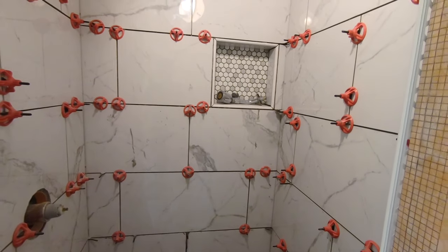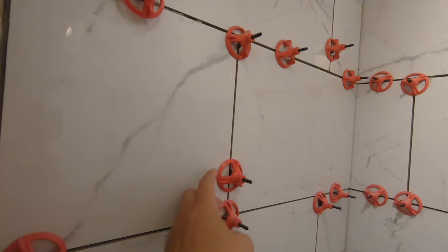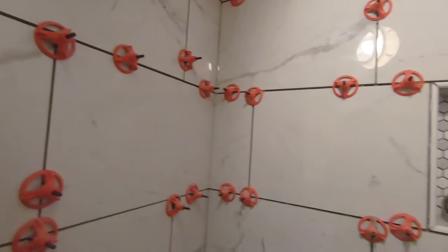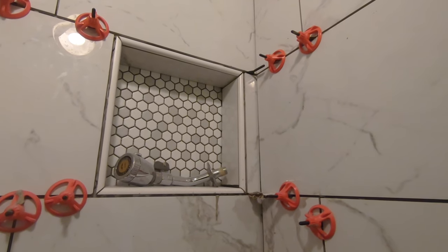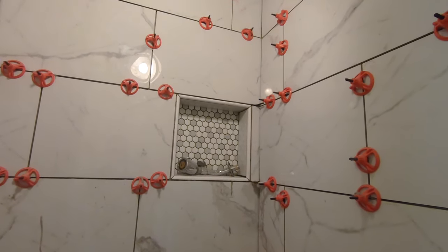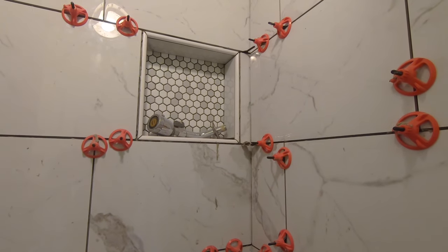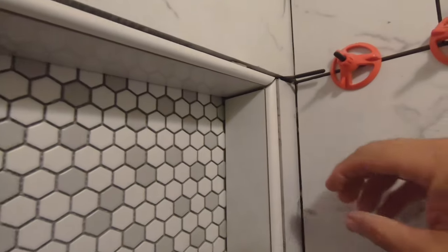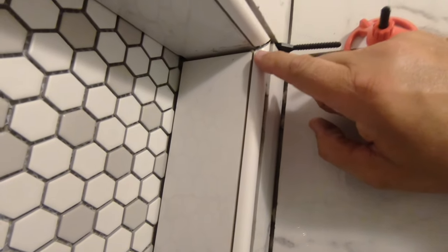Here's the shower that we're working on. As you can see, we've got the tile in and these red fasteners make sure that all the tiles are set and flush with each other. I'll show you our outside corner stuff that we've already dealt with. There are two ways to get around outside corners: one is if you have a tile that has a beveled edge on it — you buy those tiles separately, as some tiles have matching tile with a beveled edge for just that purpose. The tile we're using doesn't, so what we've done is found these strips that can be added to the edge of the tile to hide that cut edge or the end of the tile.